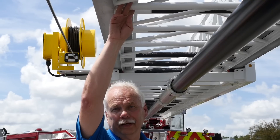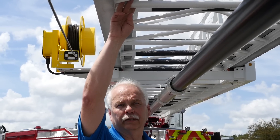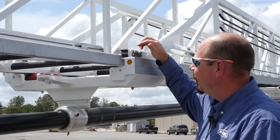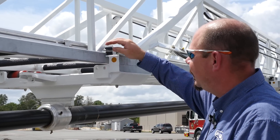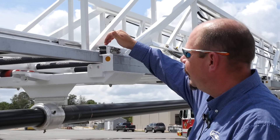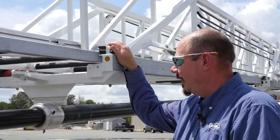We're working on achieving smooth operation with minimal friction forces. That's going to increase the life of the cables and the hydraulic cylinders because we're running under less operating pressure. We also have rollers for the side guides, with adjustments to maintain the ladder's tracking straight, plus a small roller inside that will guide the ladders as they slide in and out.